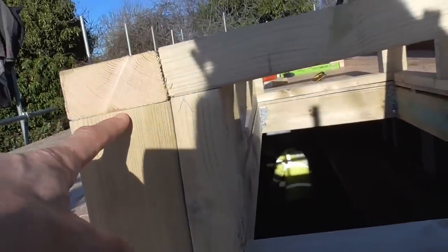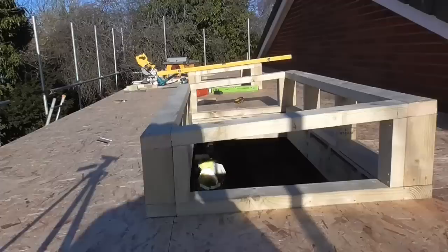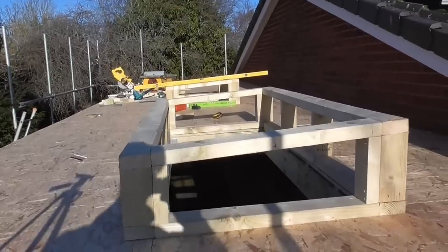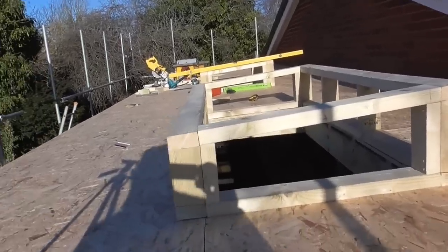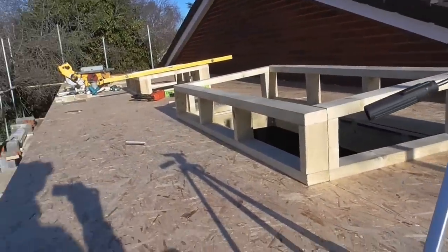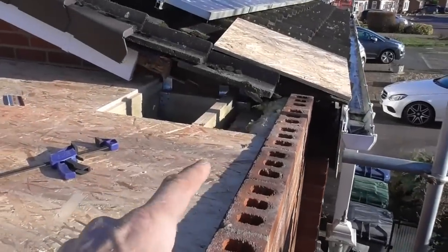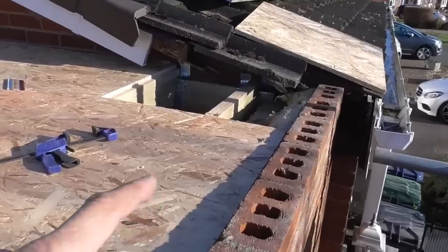We've got 1 degree cuts there, and 5 degree cuts there, and a 5 degree bevel there, and that's square, and that's got a 5 degree bevel on it, that's got a 1 degree bevel on it. But it's worth it, because those curbs are now plumb, and they've all got that pitch on top. So let's get some of this OSB up, get those cladded. We just had a bit of a block put in there. It's not freezing now, so that block's been put in there.